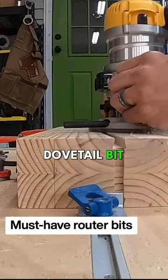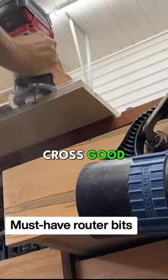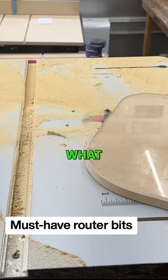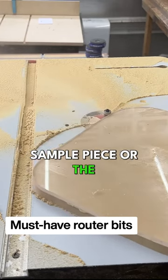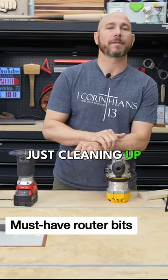I personally love a dovetail bit because I make jigs with those, like my tapering and jointing jig and my crosscut sled. These are just handy to have. Flush trim bits are some of the most used common bits in most shops. What a flush trim does is create two identical pieces because that ball bearing rides on the sample piece or the template piece, and you can use those on templates as well as just cleaning up the edge of work.